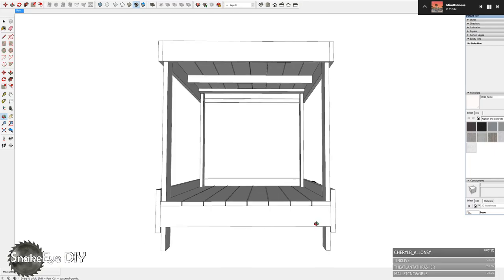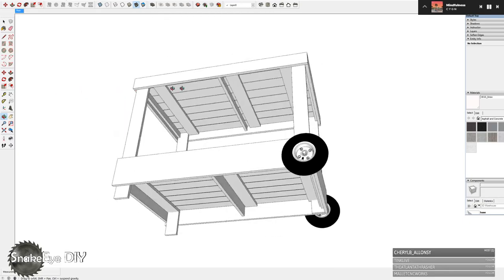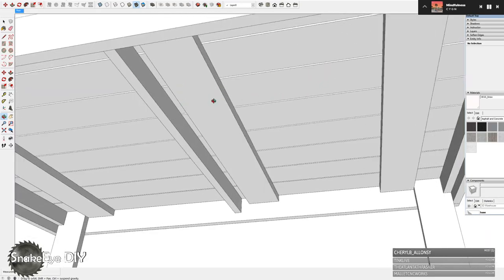That's like really, pre-drill each hole, fill it with glue, screw it in. I mean, don't fill the hole with glue. Right, so what are you gluing? Just along the top, just where the wood is going to connect to other wood. Yeah, okay. So you would glue each of these squares where the wood meets, and then put it together, and then screw it.